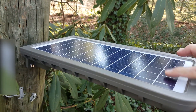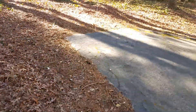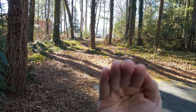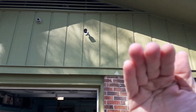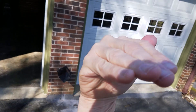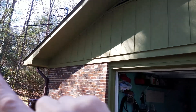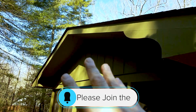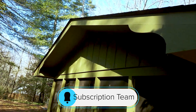Unfortunately, you can't tilt this panel or swivel it to aim it towards the optimal area. In our case in the United States, that is south — our sun arc is in this direction, which means the panel should be tilting that way towards the sun arc. Here's a wall that's facing east, and while it catches the morning sun, if the unit is tilted back, the solar panel doesn't catch optimal lighting. Plus, we have the challenge of the overhang casting shadow and not allowing that arc of the sun to give us full lighting. Anyone with an overhanging roof like this would have quite a challenge getting useful energy out of that solar panel. This is a south-facing wall which would catch most of the sunlight, except of course for the overhang, which casts a big shadow.